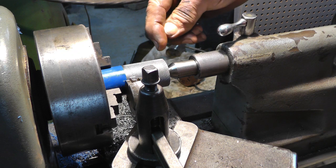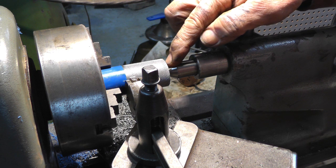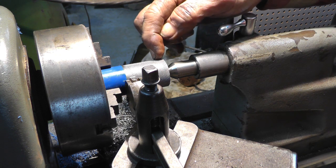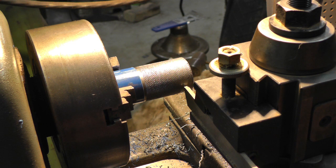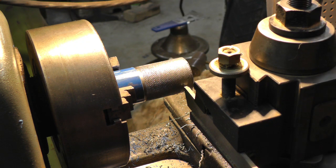Now I'll have to slice this into three. Well, I'll drill a hole. I got to have one that's a 1/4-20 for the little one. Then the other ones are 3/8, so I'll have to do the small one first and then the other two. So that'll be next. Well, got the hole drilled and tapped, and gonna try slicing one off. Thought I might as well try out the new tool post, being I got a cutoff tool already and everything else was done, so give her a shot.